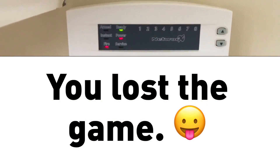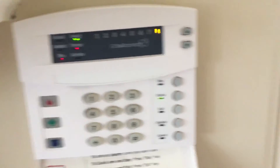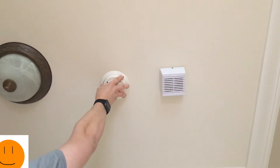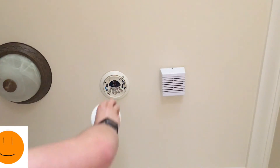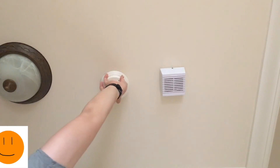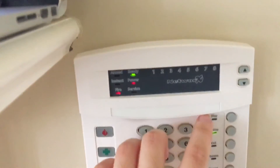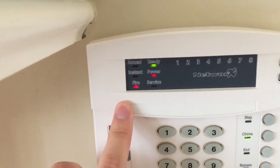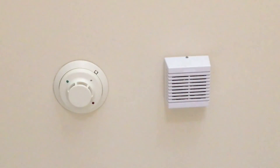I'm going to silence the system before we can reset it. You enter the code to silence the system, and then hit star 7 to actually reset it. You can see the detector did activate. I'm going to go ahead and blow out the head so it doesn't continue to trigger. This should be good now, so we can mount this back up. You can see the zone 8 light went out because we technically reset the detector, but the fire light is still on, so we're just going to reset it. I hope you guys have enjoyed this demonstration of what verification is, and I will see you guys later.